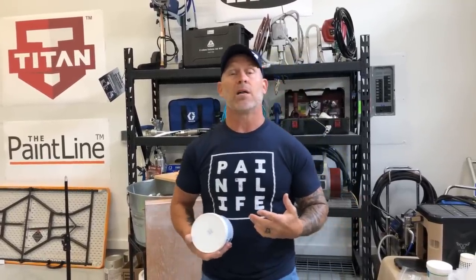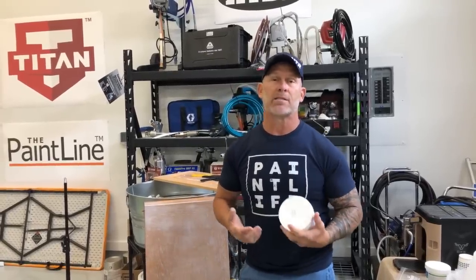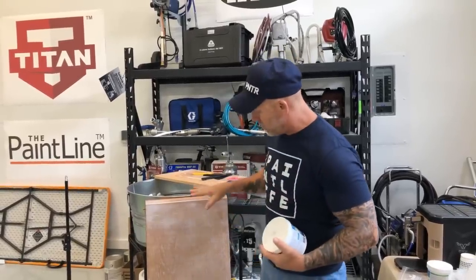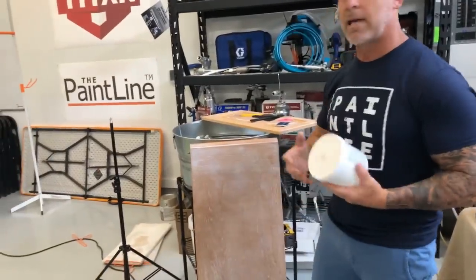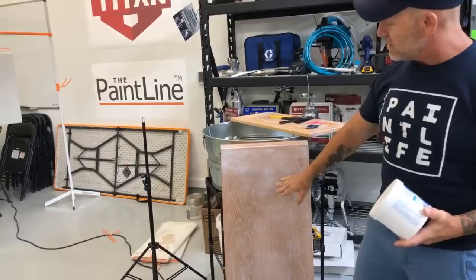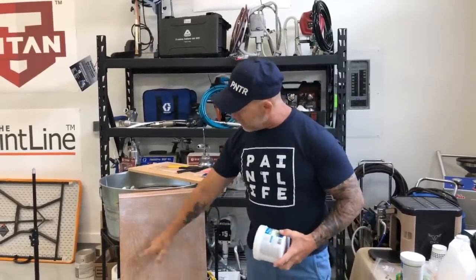And we're going to be talking about and showing you and doing hands-on training painting cabinets. It's a 2-day course. So one of the things I was going to show you is we're using Aqua Coat right here as a grain filler, and give you an up-close look at it and the product. Did it get on your hand? Well, that's just because I sanded it right there. It's not wet. That's 3 coats of Aqua Coat right there, and you can see how it's filled the grain.